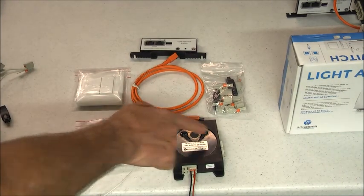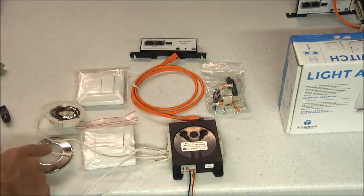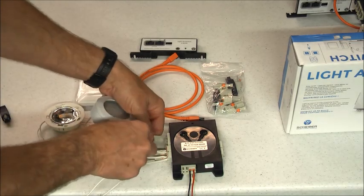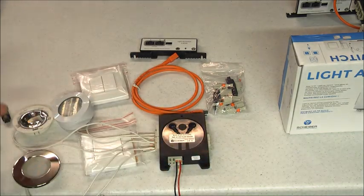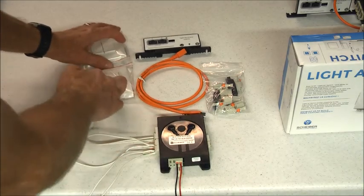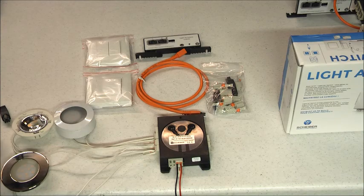There are six channels — one, two, three, four, five, six — and I'm going to simulate a boat's worth of lights by adding a second channel. This would be the salon, this would be the cabins, and this would be the galley lights. I only have one light here to show you, but we have five amps per channel so we could have multiple lights — literally dozens on each channel. It also has circuit protection, so in case of a short circuit it would turn off automatically and you could reset it like a resettable breaker.